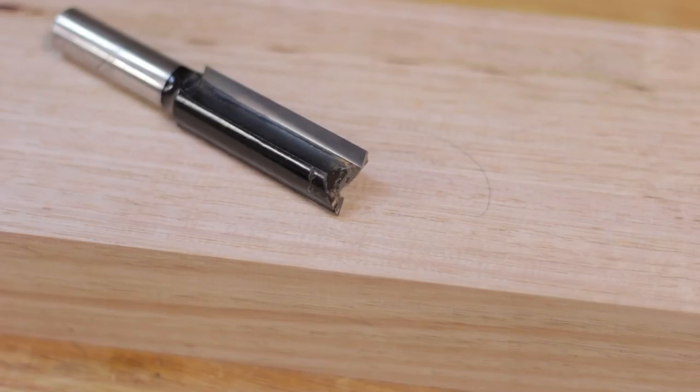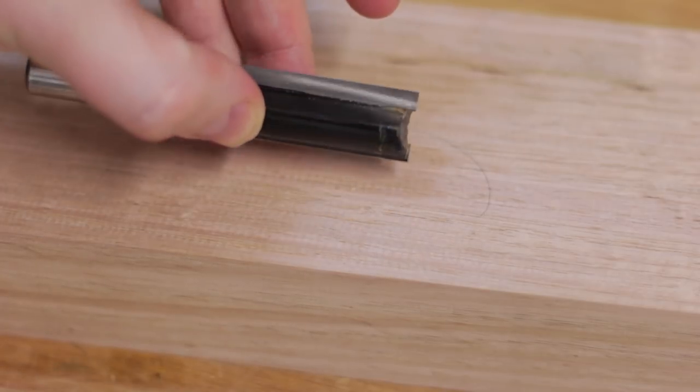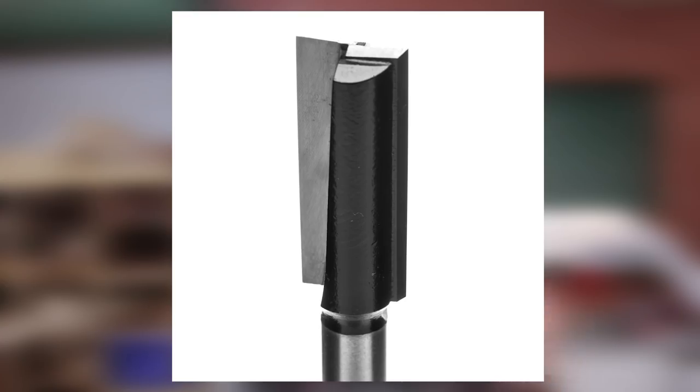The contrast to that is your standard straight bit — very inexpensive and available in a wide variety of sizes. The problem with these bits is that they don't typically have a cutter on the end, so they can't plunge all that well. There are ways around that: you can drill out where the center section would be, make multiple very shallow passes, or drill an entry hole. There are also straight bits that have a cutter on the bottom, sometimes known as plunging straight bits, mortising straight bits, or flat-bottom cutter straight bits — they are suitable for plunging or mortising operations. I have a link to a few of those in the description below.